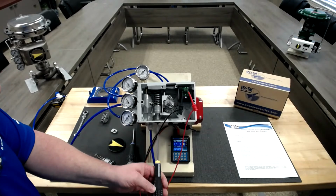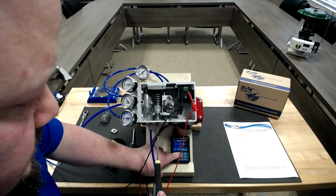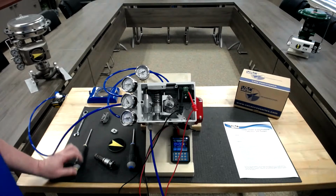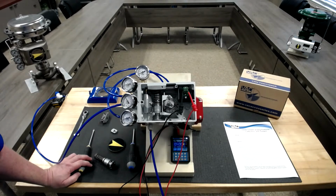We have a question from Dick, and he wants to know, why does the cam need to have a gap at the starting position? A gap at the starting position allows us to adjust the 0 down. If there is no gap, the cam is stuck in that trough. As you try to decrease the 0, you can't do it. It will not be able to move. So it allows for wear in seats, and gives you a little bit of adjustability on the 0 side.